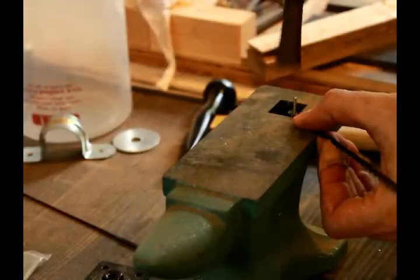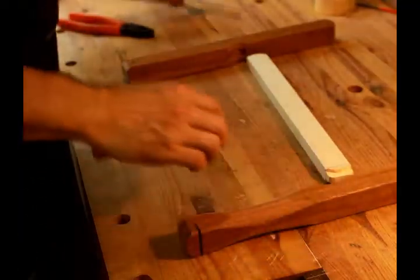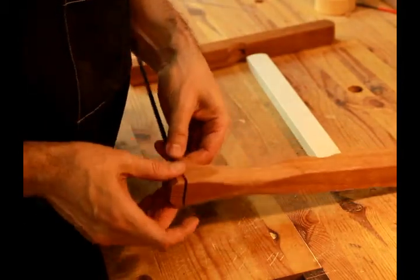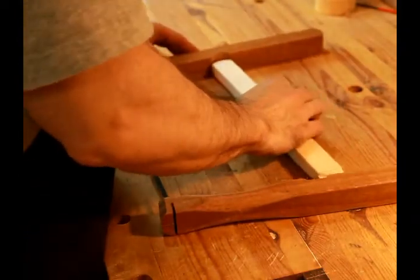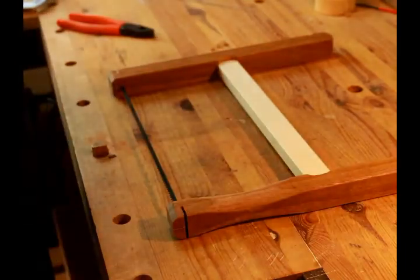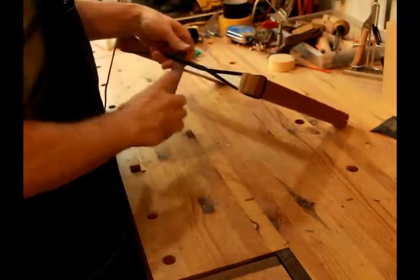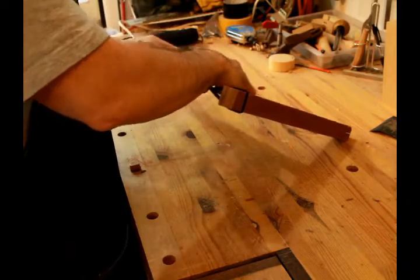I got another piece of blade, drilled some more holes in it, and was able to force the pins through this time. I decided to change the design so it works a little more like a conventional fret saw, putting large curves in the outside of the handles so I could slide the blade in with the pin already through the holes. Then I was ready to assemble the saw. I got some paracord and wrapped it around the top, tied a square knot to make sure it wouldn't come undone, then got my piece of wood to start tensioning the blade. Luckily the pins held and I was able to tension up the saw.